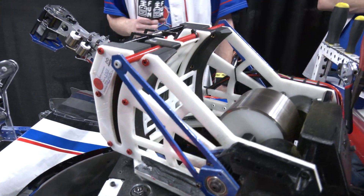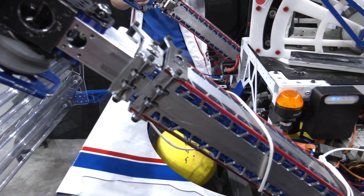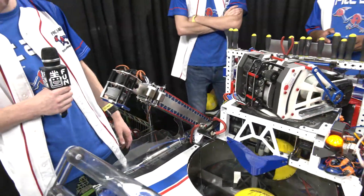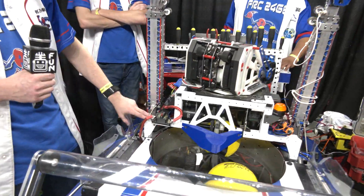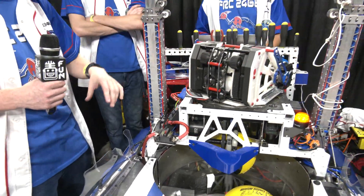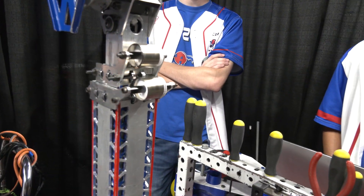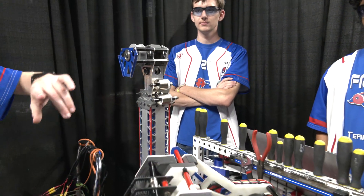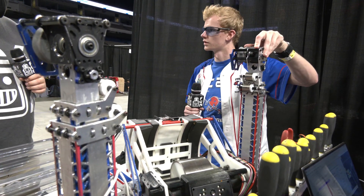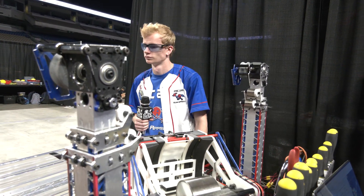Next is the climber. It looks like it might be able to do some translating on the switch as well. Initially we have it down so they can be longer — we need three stages instead of four. As they go up, we have them pneumatically actuated. When they're up, we have strings that hard stop them to the right angle. We have a winch centrally located in the back between the two drive rails, with a stringing system to get it up into each tubing. It's continuous — goes up to the bar, three stages, and we have constant-force springs to spring it up so we only pull down. We're planning to have translation on the bar, but we didn't quite get there because it bends the arms apart. This is our clutch — we have a servo that pulls this apart as it allows the clutch to spin, for locking on the bar when we're where we want to be. We also have a motor with double gears and a color wheel on that side, though we had to take it off for the competition.